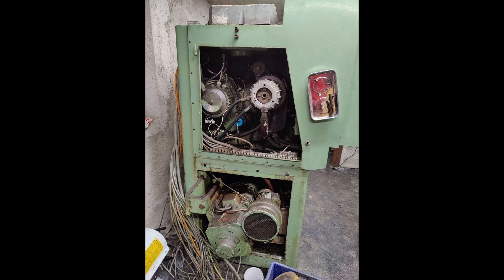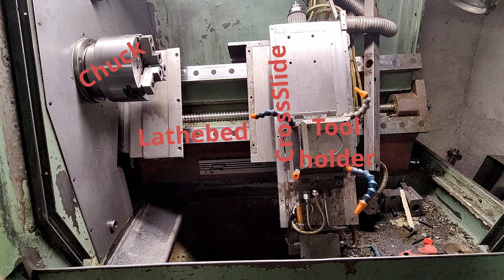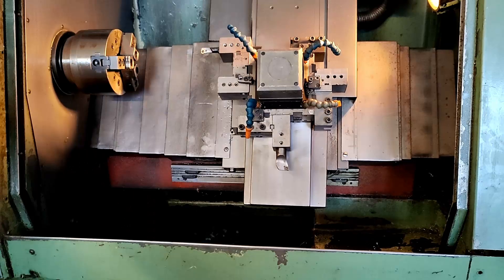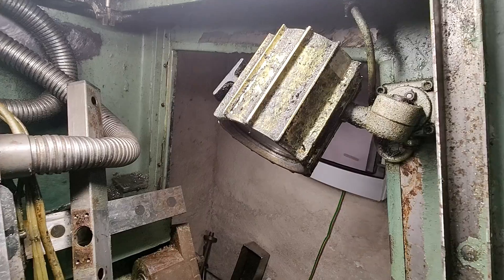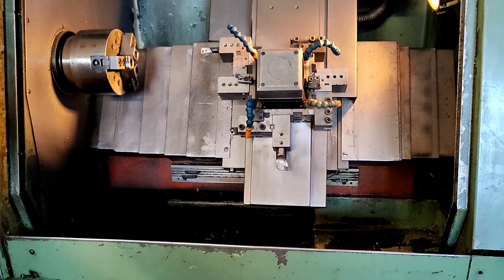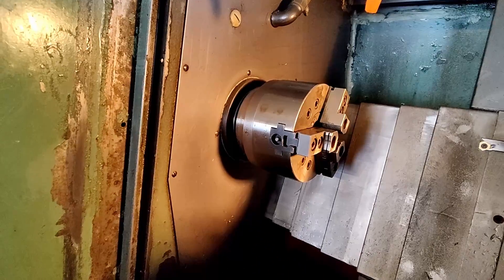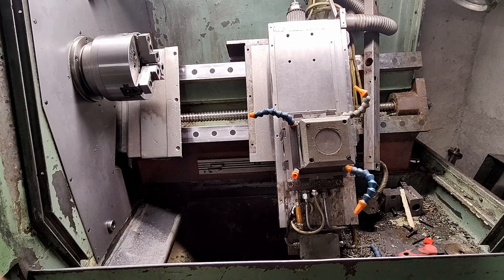Here's a view of the machine as it finally reached its new home. In the lower part is the spindle motor with a separate blower motor for cooling, connected with a belt to the spindle. We can also see the motor of the Z-axis. On the other side you can clearly see it still is like a normal lathe — with a chuck, a lathe bed, a cross slide, and a tool holder — but everything is bigger and engineered for automation. The whole machining area is watertight so coolant won't get everywhere, and the bed is covered in watertight steel cladding. A big bonus is the tool turret, which lets us mount multiple tools and automatically change them by turning to one of four positions. The chuck is opened and closed with a push of a button — both done hydraulically.